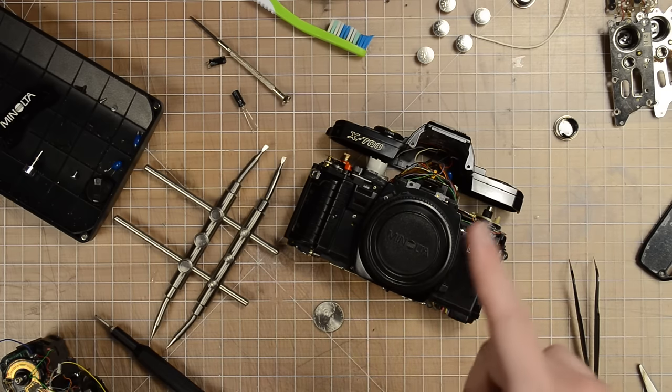With the top coat finished, we can finally put our spray booth where it belongs and get to peeling off the masking tape. My masking job was okay, but I did end up having a little bit of tear out on the edges because I waited kind of too long. What I realized is that what I really needed was masking fluid — basically like liquid masking tape. You brush it on and it dries into this little rubbery stuff that you can peel. Moving on to the detailing: I'm just using black, white, and red, which is simply my logo branding color scheme. Unfortunately, when I was doing the detailing, what I didn't realize is that the polycrylic takes a week or more to fully cure. So in a few areas where I was wiping off the excess paint, I kind of burned through and melted the polycrylic. This isn't the end of the world — I can still go back and fix it, but I'm going to have to wait before I can wet sand it.